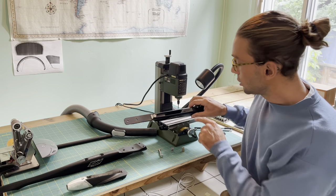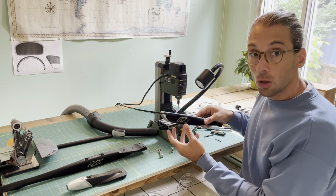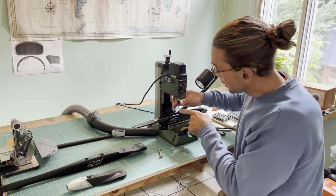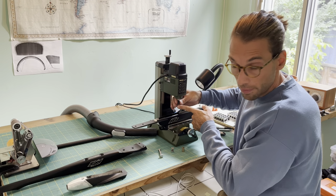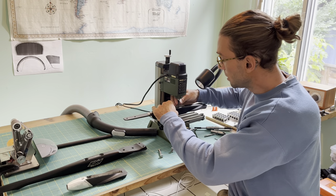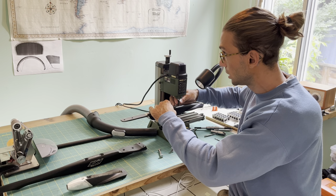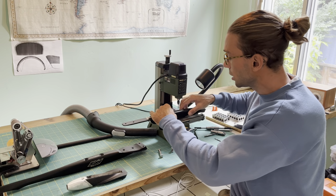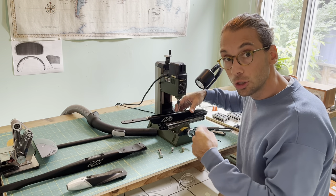The technique is to remove the sides one by one, then remove the middle. Always mill in a direction such that the clockwise rotation of the mill causes the cutting edges to grip the material rather than skip over it — in this case, that means moving counterclockwise, so the teeth are always gripping the material.